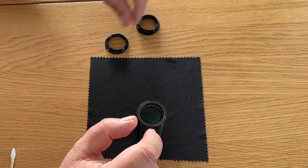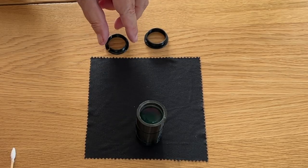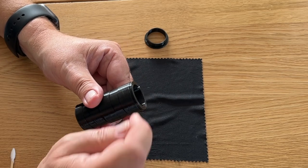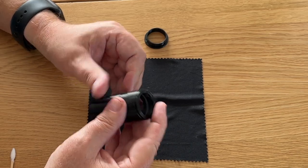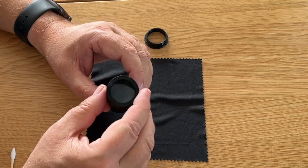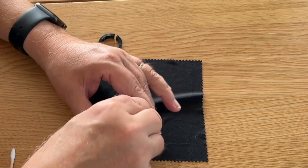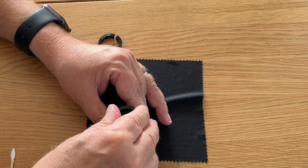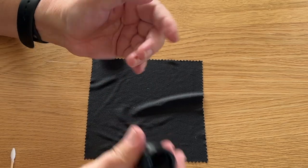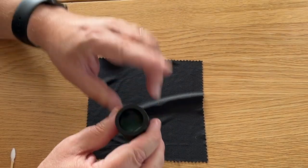Press lightly with a cotton swab to make sure it rests on the shoulder. Do not press with your finger to avoid messing. We will now attach the collimator lens in the tube with a split ring. Be careful — there are two rings in the kit and it is a trap. One is thicker than the other. The one to use here is the thicker one. If you mount a thinner one, there will be no gap between the tube and the ring, and shaking the tube will reveal the lens is free inside — which is not normal. Remove the thin ring, replace with the thick ring, push it in well, and confirm there is a gap and no more noise when shaking. The thin ring will be used later.